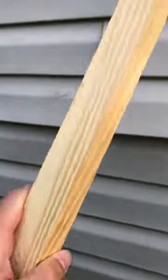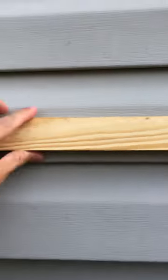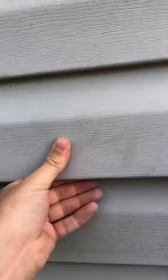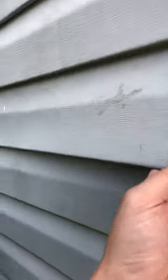Get yourself a one by two — fits right on there, pretty good, about $1.70 at Home Depot. This is laid underneath so when you push down on it, it doesn't collapse and crush your siding. It's gonna give your siding the space it needs to move back and forth. You pull it back and stuff it in there like so, and that will keep your ledge. When you put your ledge on, it's not gonna crush your siding and it's gonna bring it out to your window length.